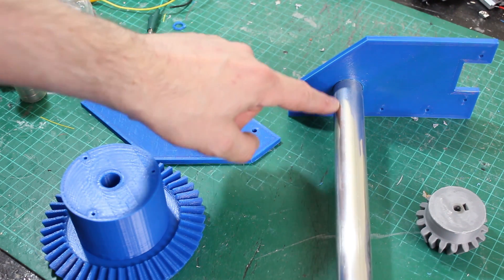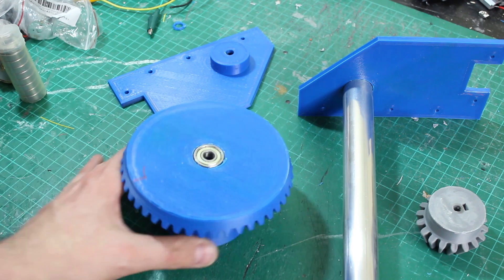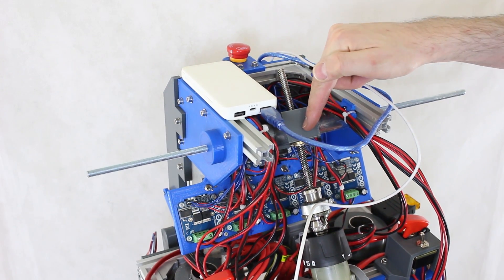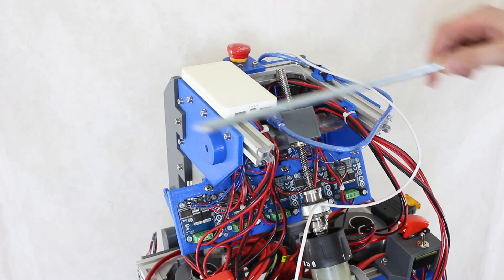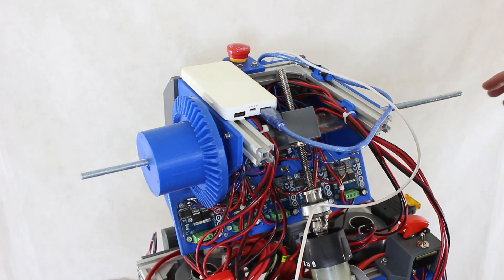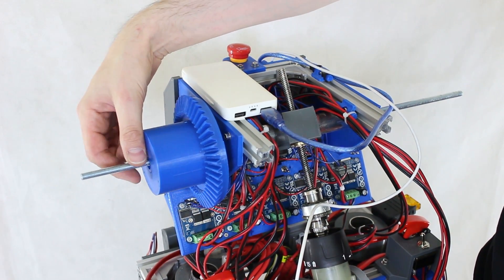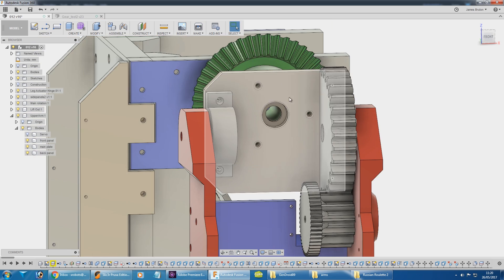I've designed new side plates for the robot. The aluminium tube goes into a recess and stops, and there's a hole for an 8mm bit of studding that matches the hole in the bearing in the bottom of the bevel gear. There'll be another bearing at the other end so it's supported at both ends. I've got my new sides installed with the piece of 8mm studding going all the way through. We've still got the silver tube that the actuator for the front-to-back pivot rides on. To relocate the arms in the future, we'd just move this around somewhere else along with the corresponding motor for the bevel gear.